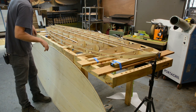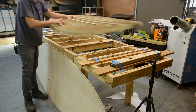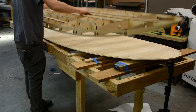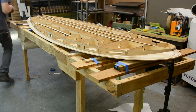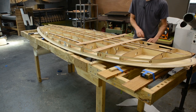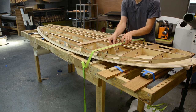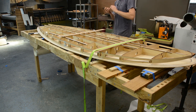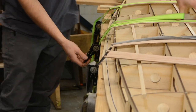That's everything done on the rocker table — we've added some springs to help keep things into the concaves if needed. We'll carefully remove the frame and lift our skin into position. You should be able to see the benefit of setting up the rocker table correctly by the fact that when we press down, everything comes up nice and tight. For clamping I actually use ratchet straps built into this bench, and I'm using a strip as a caul to distribute the clamping pressure across every single rib. For the dry run I'm just going to do it in two to three positions.